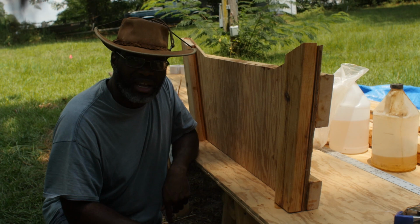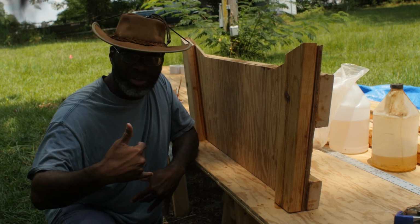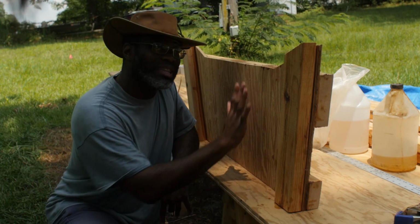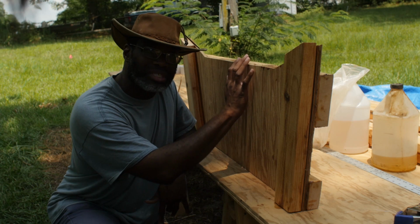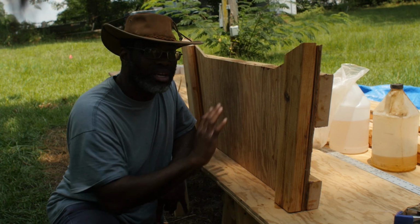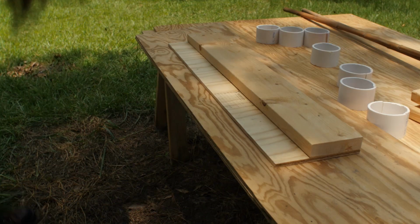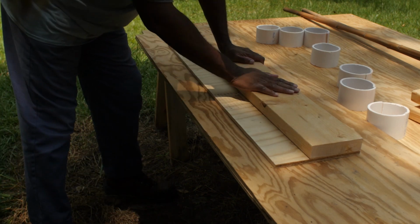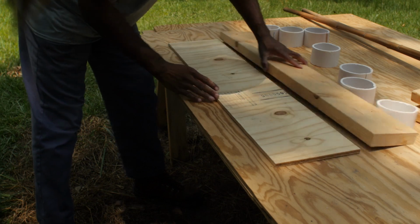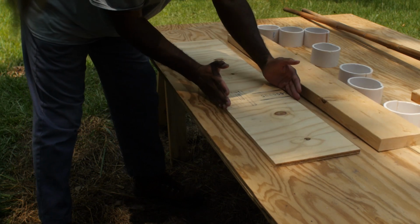If you look at a lot of the Thai longtails in Thailand, they mount them inboards, which means the engine is further inboard and further forward, so the boat is ballasted better. I think we can get a similar ballast if we just make the back of the transom straight up and down and don't even worry about tapering it at all. Okay, so the bow, the process is just like the transom. The bow is essentially about half the width, half the depth of the transom.